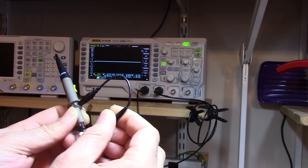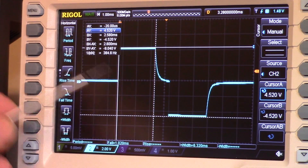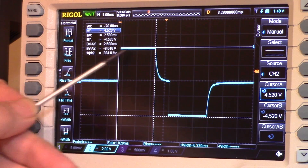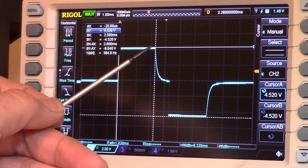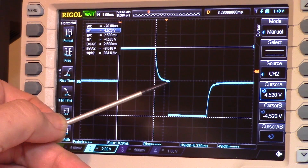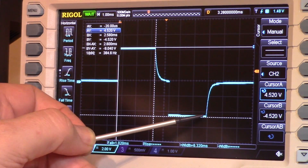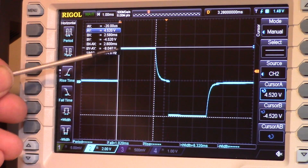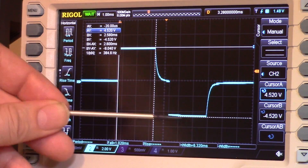Here's that pulse we were just looking at — that once-a-second pulse. I've just set up the cursors and rulers so we can take a few quick measurements. We can see this period where it's held high is 2.6 milliseconds, and then after that we get dragged down to zero — it looks like a capacitor discharging — then dragged low for 2.6 milliseconds and back up to zero. The top value is 4.5 volts, which matches up with our three AA batteries, and we've got minus 4.5 volts for the negative as well.